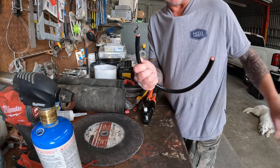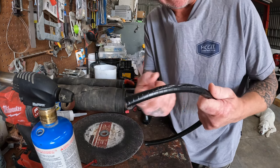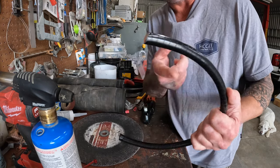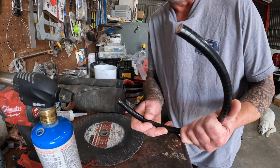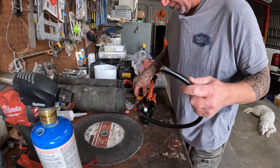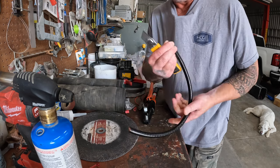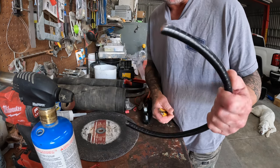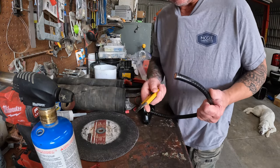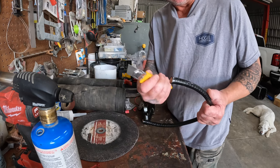This is going to be my negative wire that parallels my batteries together. It's the same red wire I have in there, so I actually wrapped it with phase tape because I didn't have any 2-ought cable. It's 2-ought cable coming off my batteries to the rest of the distribution — I just did a layer of black electrical tape over it. People say to buy wire strippers, and obviously being an electrician I've done this more times than I can count. I've always used a knife, but if you're not used to stripping wires then yes, purchase a wire stripper.